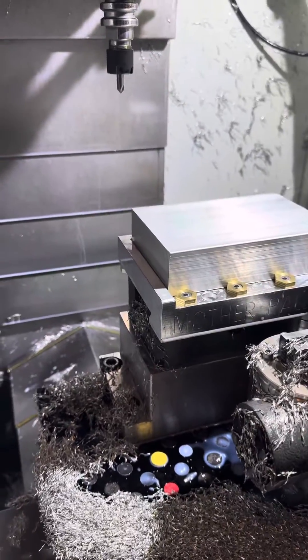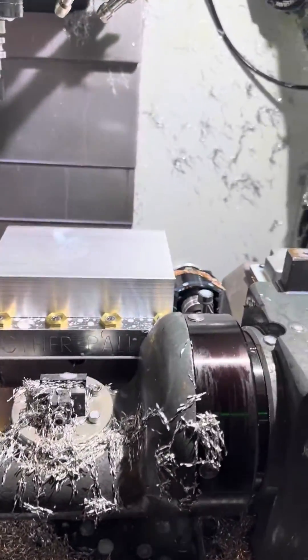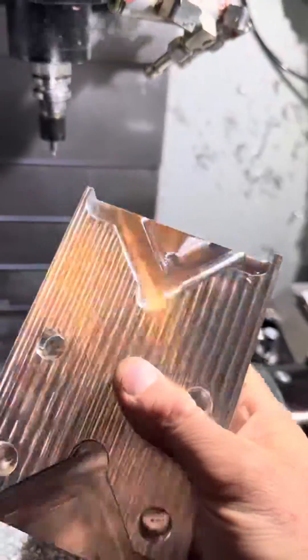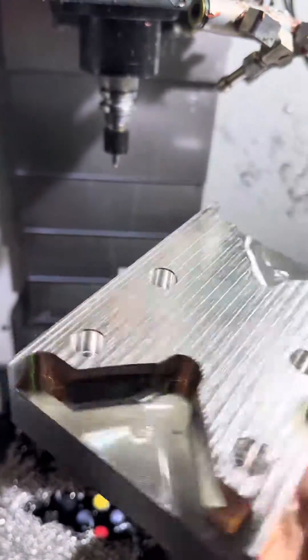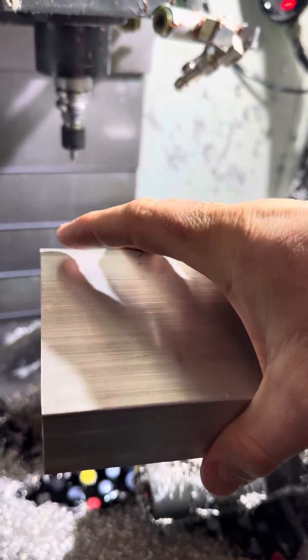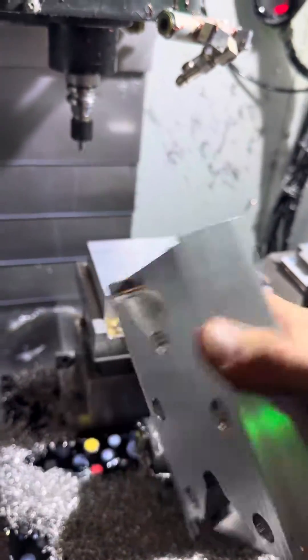He said no, so I went and designed my own — really simple — to where it just has the two dovetails at the end and then four places, four pins. I only used two of those slots. You throw it on top, it locates on the pins, and then you tighten down and the dovetail clamps it down to the vice and repeats.